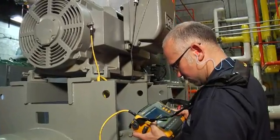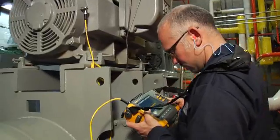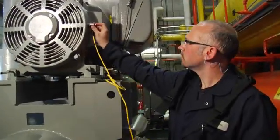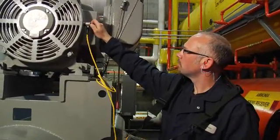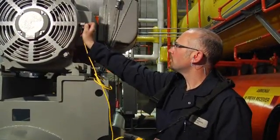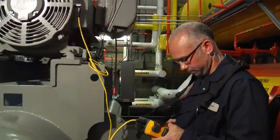We have a brand new compressor with a 600 horsepower motor. We hooked up our new Fluke meter and did three separate tests, and they all repeated exactly the same, and did actually find some slight motor bearing end wear on each end. That's helping us get some of these problems taken care of before things like that go out of warranty and become our problem financially.